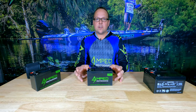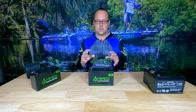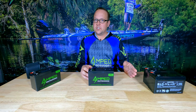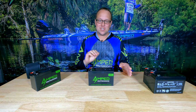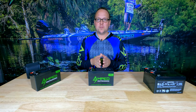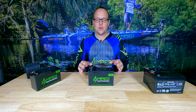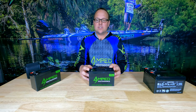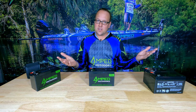One of my highest recommended batteries is the lithium iron phosphate. They're extremely long-lasting with a very unique performance characteristic. They charge up to 14.6 volts and discharge down to 10 volts. What's really nice is they discharge at a very consistent voltage throughout the cycle — it'll charge to 14.4, rest slightly lower, then discharge at around 13 volts for almost the entire battery life, giving you good, clean power. Over 95% of its usable capacity is delivered above 12 volts, giving better performance and longer run times than lower voltage packs.